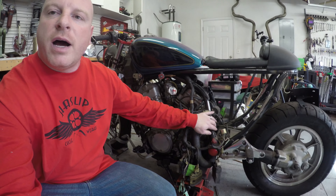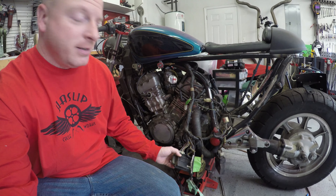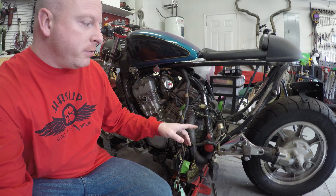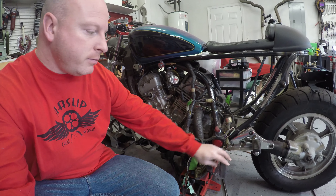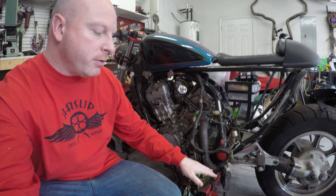And then we're going to build a gusset that goes from here to here and on the other side as well. And I'd like to do some sort of maybe stainless or just regular expanded steel mesh to go over that so that we still have airflow for things like our CDI and our voltage regulators that do get hot. That'll give them the cooling they need, but still hide them — because God knows this stuff is ugly. So let's get ready to start cracking on that.